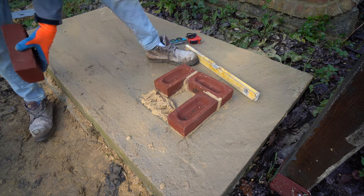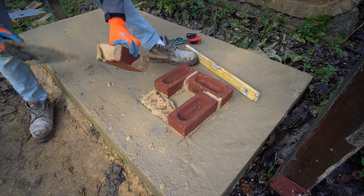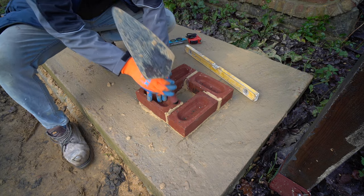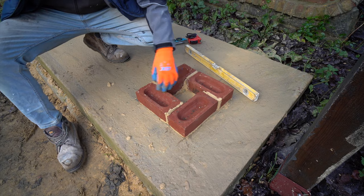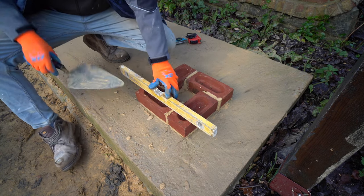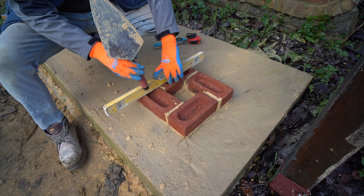Grab a nice clean brick, butter that up. It's a little bit awkward doing it this way just because you can't butter the other side up perfectly, but it works. Plonk that one in. I've got a couple of those in so I'll grab my level, get a fill, and plumb them and level them over. Turns out there was a bit too much muck under there, so we'll pull all that muck out and clean it up. These look well out of square, which is exactly why we're going to square them up in a second. Just want to make sure it's all level.